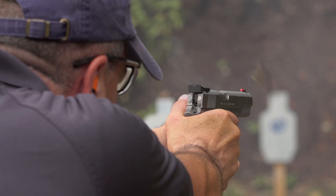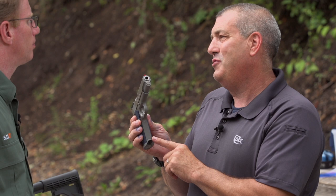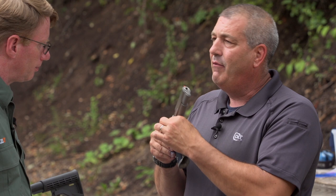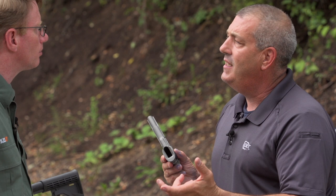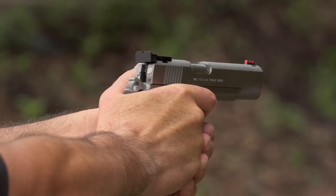Some of the real advantages of this gun that I get excited about: we have a high grip safety, we've undercut the trigger guard, we've checkered the front strap 25 lines per inch, we've checkered the main spring housing 25 lines per inch, and we've also installed a magazine funnel to aid in reloading. For bullseye shooting that's not always necessary, but there are a lot of people that can use this gun in action shooting where fast reloading is essential.